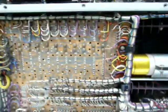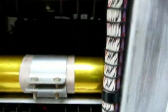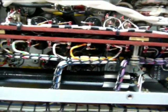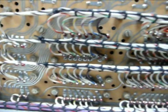Quick look at the underside here — beautiful wiring looms. Just look at that, neatly tied and bundled. Absolutely lovely. And here we've got the switch — ceramic rotary switches. Great big resistor, that'll be the input divider for the 2kV range. The input silicone cables again, because these could have 2kV on them. High precision resistors, all on tag board. So this is the back plane for all the cards, all the wires going down to solder posts, all loops out exactly the same amount, all individually coloured. They don't make things like this anymore.